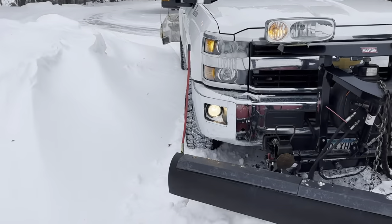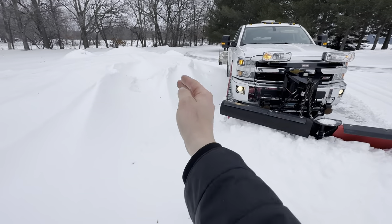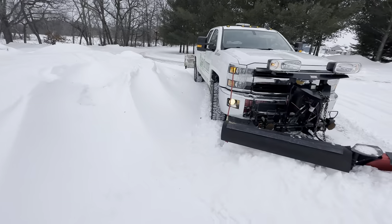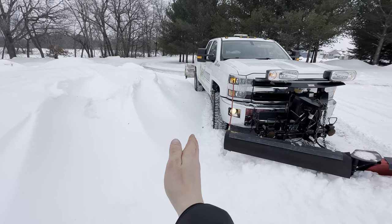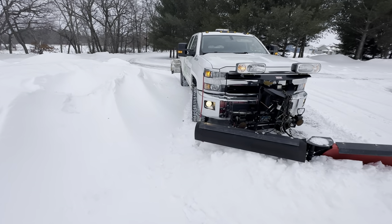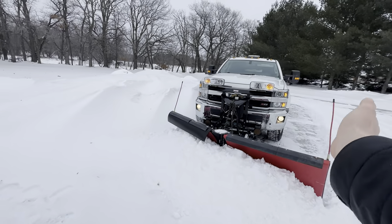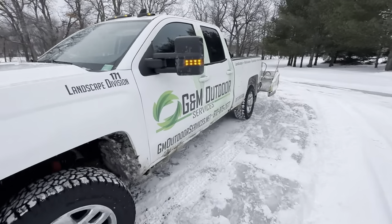In order to efficiently do that, the plow has to be out past the truck. Even with a 9'6" it's still not enough. Look at my tires — barely turned and I'm two feet over from where I plowed. I just came plowing up here and turned just a little bit. This isn't even a sharp corner at all, and I'm driving way over here. In order to efficiently do any kind of radius, your wing has to be a lot farther out. That's where you need a Wide-Out, a SnowPower, a back plow — this front V-plow just can't handle it.